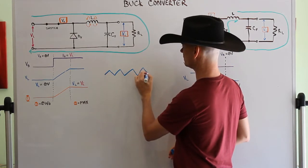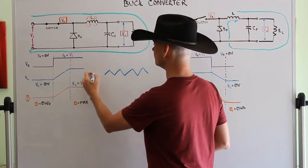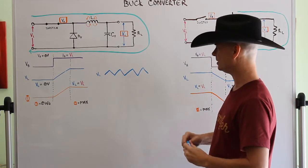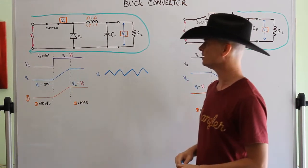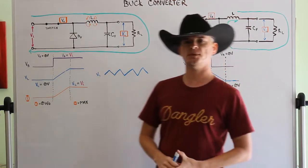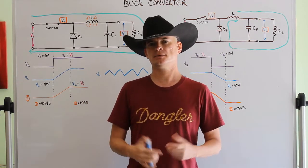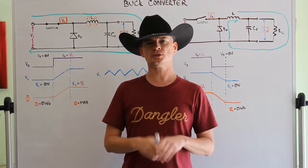You might notice the output voltage is going to look kind of funky. You're right - the raw output of these things isn't smooth like a linear regulator gives you. These things will give you something like a rippling waveform, not a nice clean line. However, the advantages over linear regulators are that they're very efficient, they don't produce a lot of heat compared to their power output, and these days they're comparable in size as well.